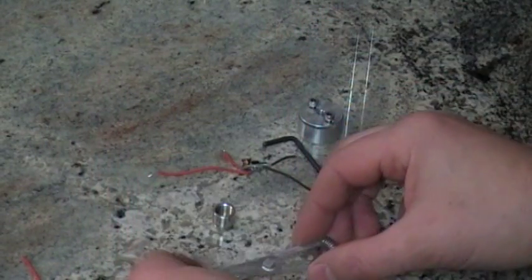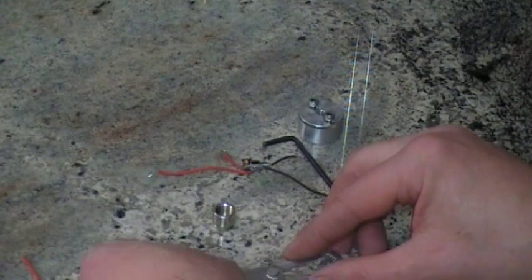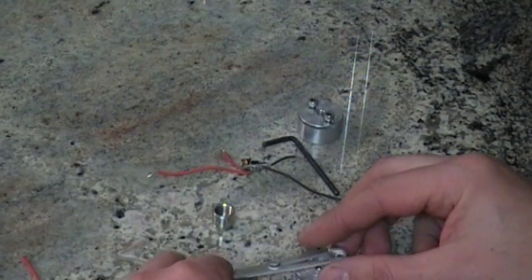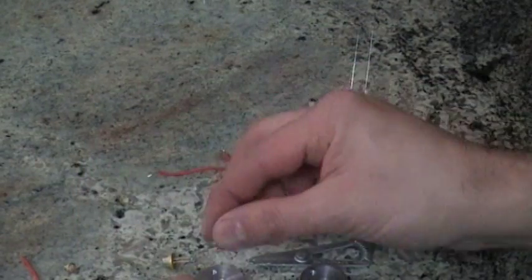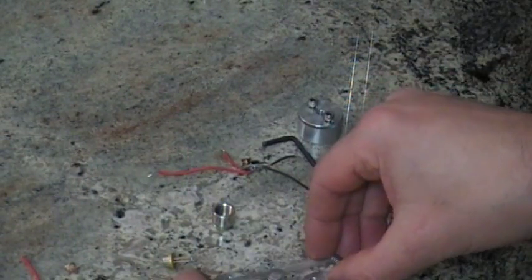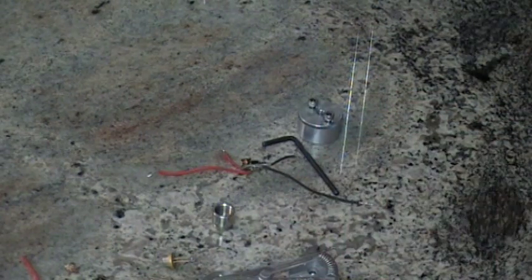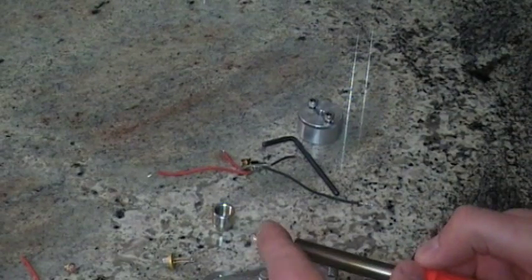What I usually do is set it down and try lining it up real good. As you can see, the pins on this one are bent — these are some bad diodes. I also don't have a static strap on right now, these pins are both straight. After you've got it sitting like that, you begin to solder — just put a little dab here.